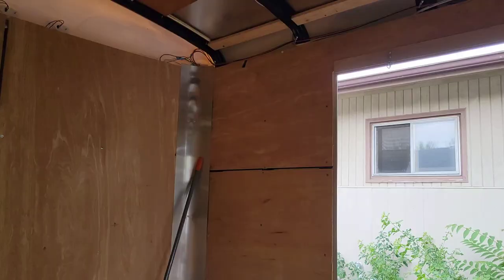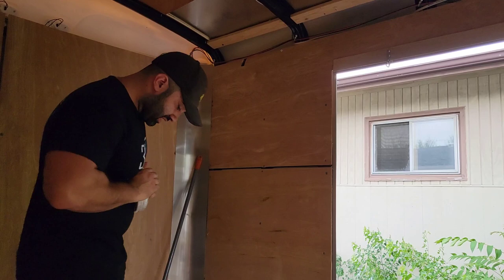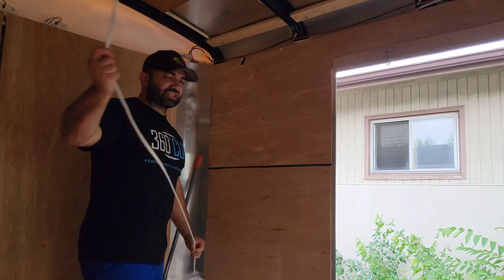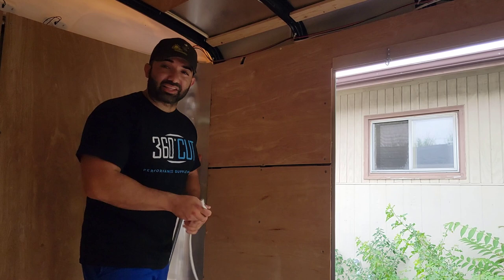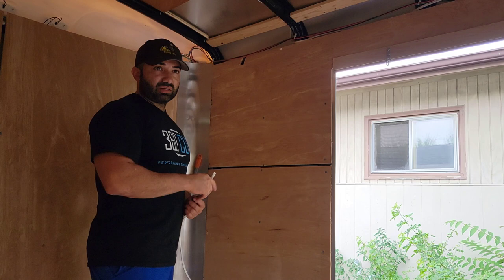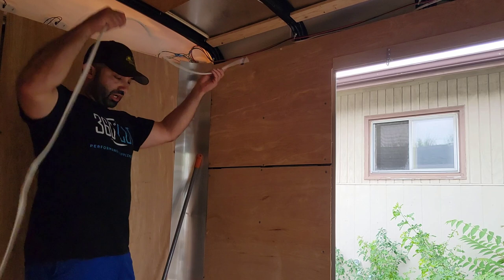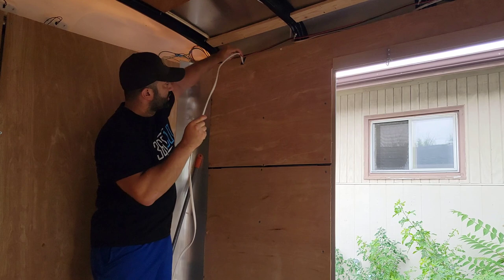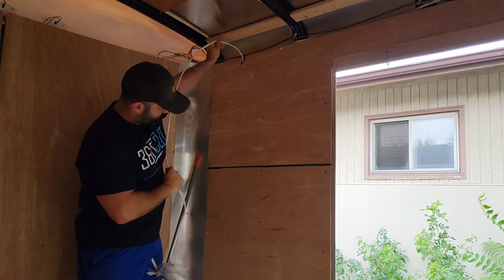Let's run this last wire, which ends the rough-in electrical. Then we move on to stainless steel. I need to buy wire-mold boxes — I'm going with two-gang deep boxes. Two-gang means you can add two different devices. I'll need about seven double-gang boxes and two singles. This last wire feeds our water pump outlet and switch. Remember, power always goes to the switch first if you're using it as a switched outlet.